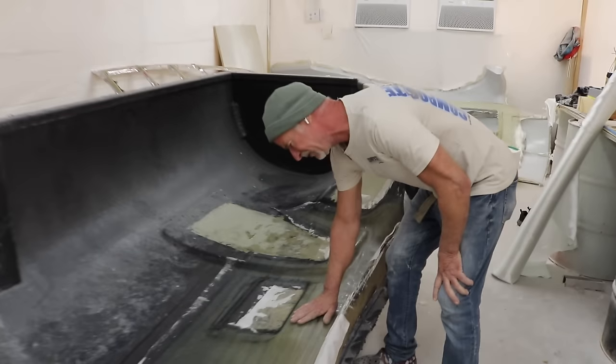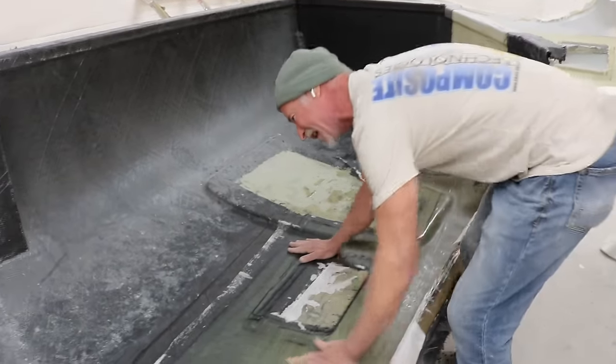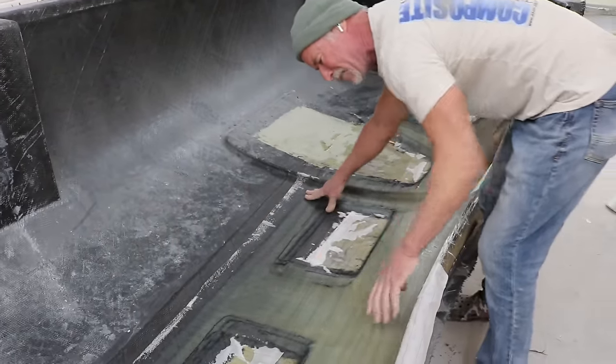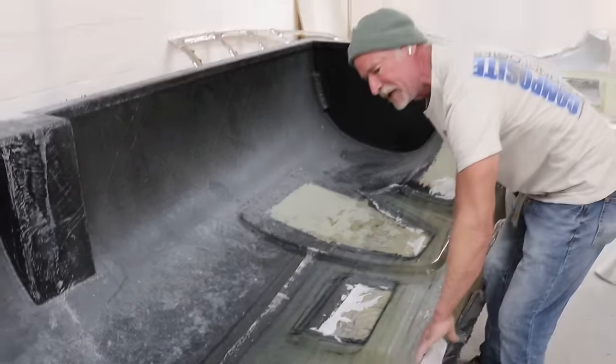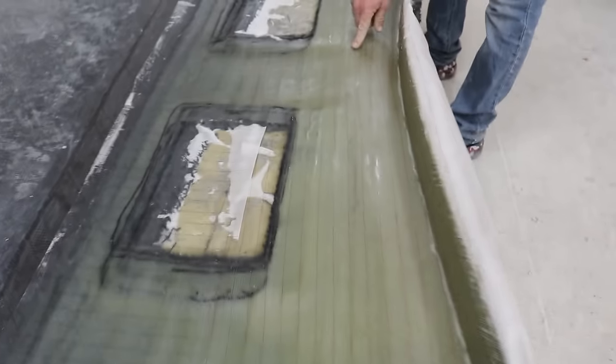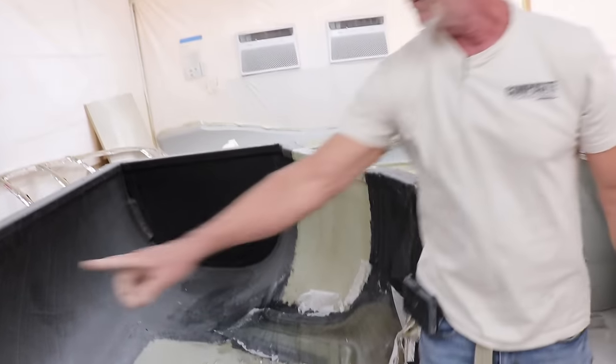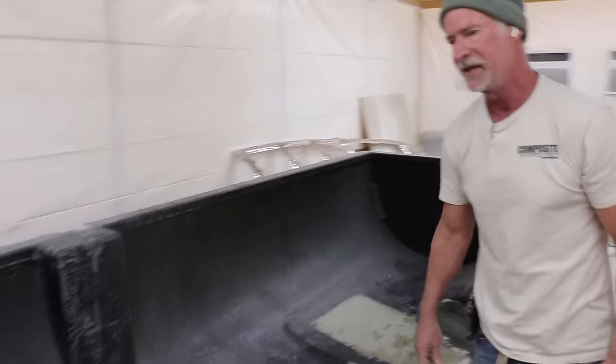He was telling you about the flange, so here's your flange. You can see it goes all the way throughout the body, and then we put these mullions in here that give the plane its strength and structure. But here's how they do that flange, and it's all done peel plied, no air, it's beautiful. And that's where the gear goes in. You'll see that in a moment.